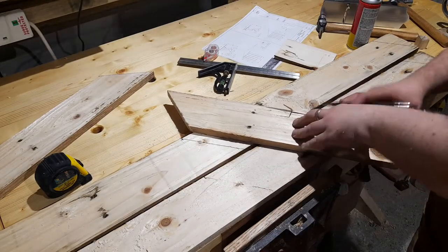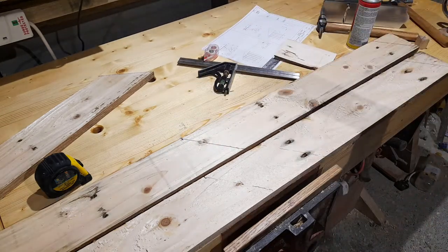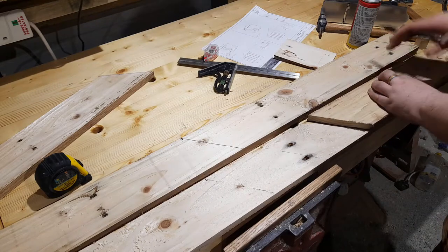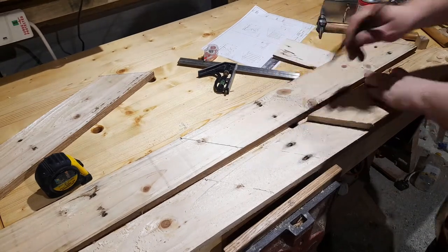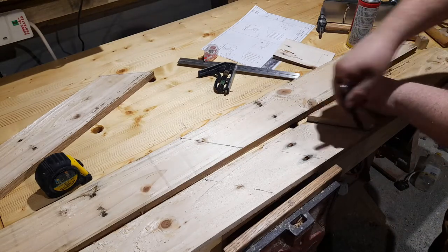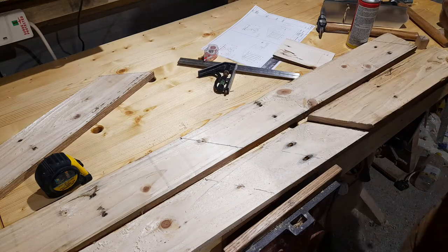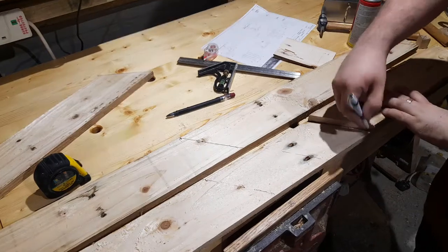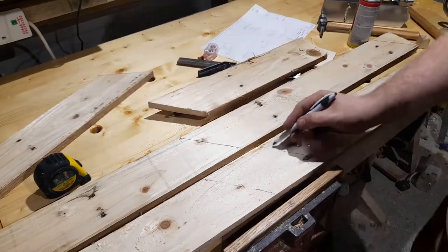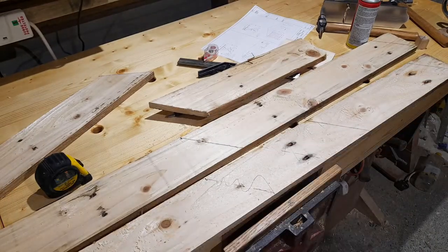And then finally, I put a little mark there. And I'm using this off cut, which is at the same angle, to know I'm using the right angle. And then wallop. And that way, right, if the pen worked, and then I just score along there. I know that's my full line. I'm just going to scribble these, make sure I don't cut them. That's the easy way to work out the height of those guys.